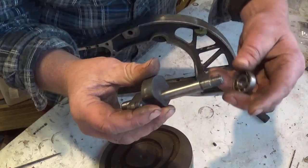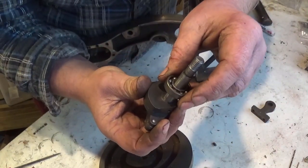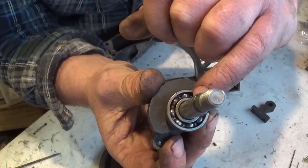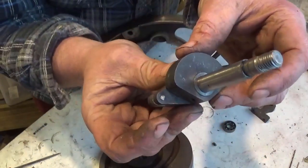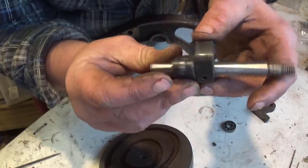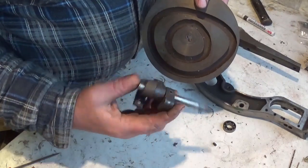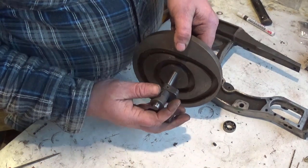The shaft runs through an unshielded ball bearing which was heavily contaminated with factory dirt when the machine arrived. Two cams are mounted on the shaft which operate the foot. The tail end of the shaft sits in a plain cast iron pedestal which is a millimetre oversize, permitting excessive movement and binding of the ball bearing.